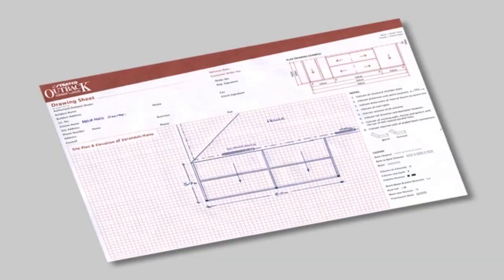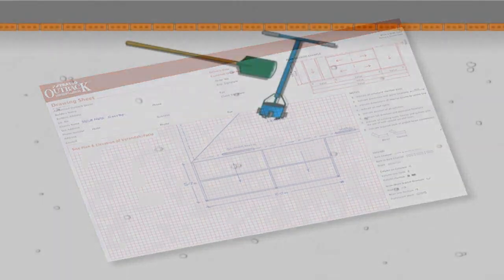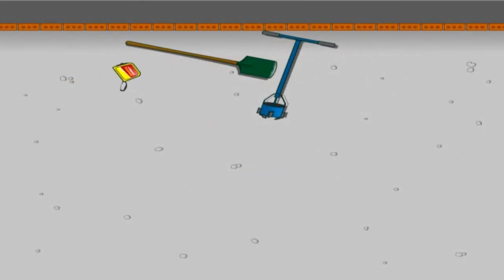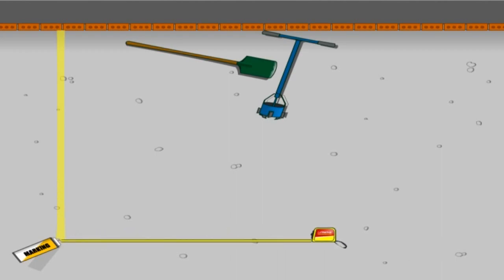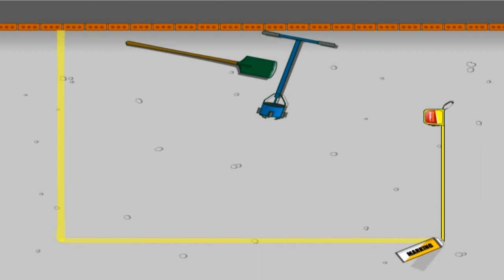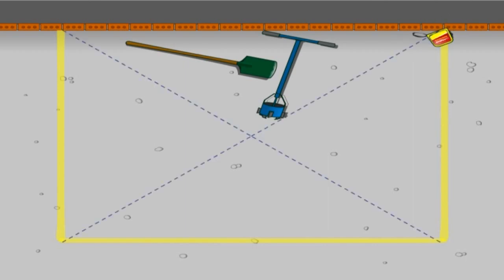Getting started. First, get your plan of the intended structure and house showing all measurements. Mark out the overall area of your veranda, patio or carport and ensure it is free from obstructions. Beam to wall connections can cause difficulty if they coincide with door and window openings, so avoid these in your design. Ensure there is reasonable access for materials and working space and consider the disposal of runoff water. Check the post and beam positions on the ground.